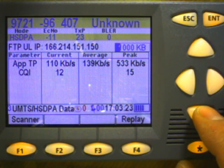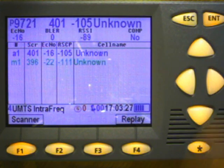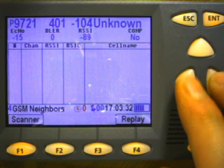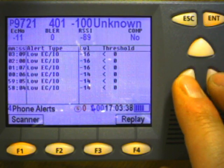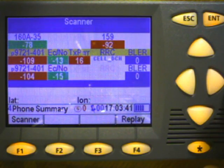If I go to device number four, this is on a UMTS voice call. Here I'm looking at the intra-frequency neighbors. I can cycle through multiple screens. I can look at handoffs, over-the-air messages, and alerts associated with the UMTS. And back to the multi-phone screen.